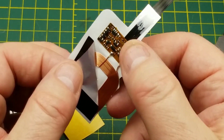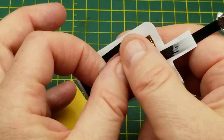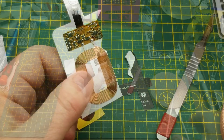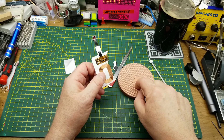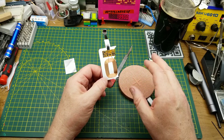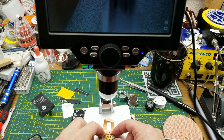There's a little metalized sticker, which means it only works with this side — the side with the little circle — facing your charging puck, not the other side, which reflects and shields from that direction. So then we have the circuit board and a coil of wire acting like a receiving antenna, or like the secondary of a transformer. What's happening is the charging puck takes incoming DC, chops it up into fairly high-frequency AC, and puts it onto its own coil antenna, transmitting — or transforming — it. It goes from electrical field to magnetic field, is picked up here, turned back into electrical, and that AC signal appears on this board.